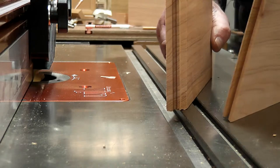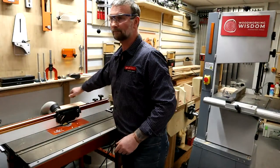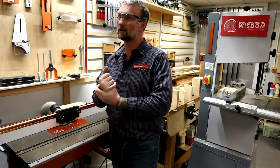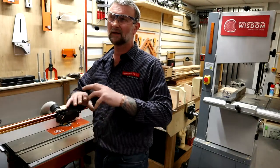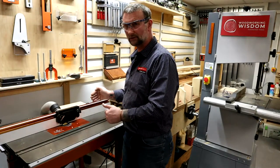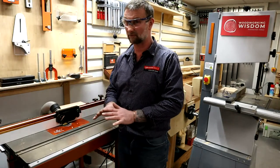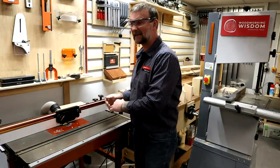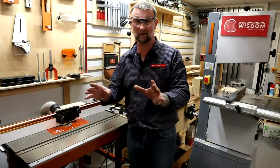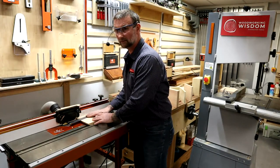Now, they're horizontal boards. Now we do the vertical boards. And another question. He's asking again, could you do that in more than one pass? You could, yeah, you could eat your way into it. On hard material, maybe you do that. Probably wouldn't improve the clarity of your cut, but remember, you've got to get back to that exact fence position. The protrusion of the cutter through the table and through the fence is everything on this joint. That's critical. So if you want to take a little nibble away first, great, but make sure that second cut is your setup cut, the final perfect cut, using the board and ruler trick that I showed you.